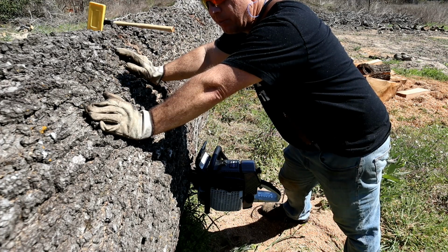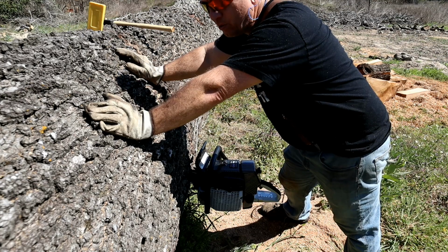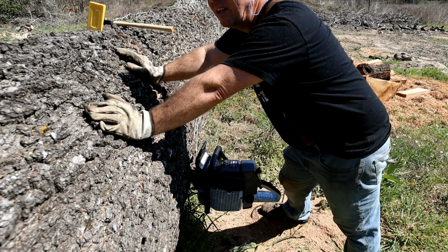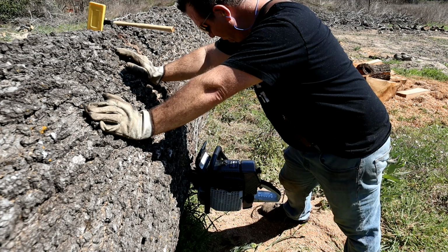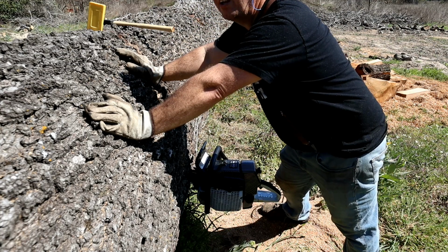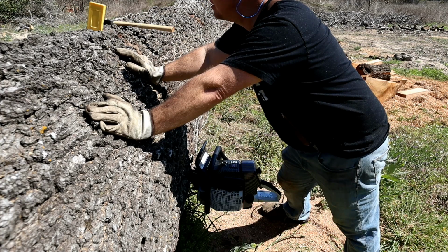I've seen that with other people where they swap out the cylinder and then still end up cooking the saw. They cook it, then they swap it out, and then they cook it again. Could be bottom end, but it feels to me more like carb related. So I'm going to have to dig into it again. Maybe get a new carb for it. I just don't know. It's an old beat up tree service saw.